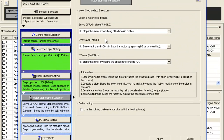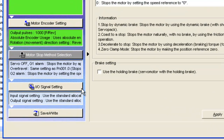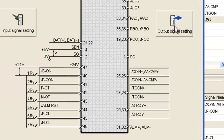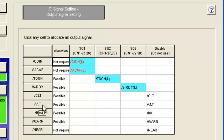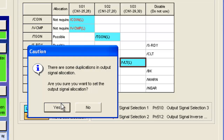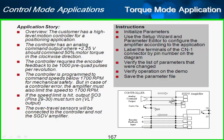The motor stop section has to do with stopping at alarms, and nothing is mentioned about that in this application. There is a speed limit mentioned, but that's not part of this area, so I can skip over it. Moving to the I/O setting, output SO3 should turn on — that's the velocity limit output. I'll go to outputs, find VLT velocity limit, remove the default, and put velocity limit on SO3. I'll click OK, confirm the dual allocation warning, and now the graphic shows velocity limit on pins 29 and 30, just as expected.